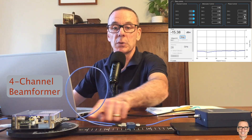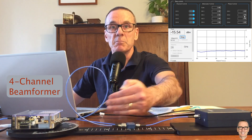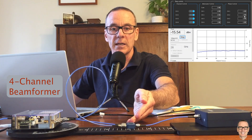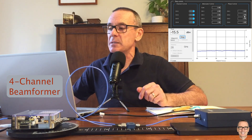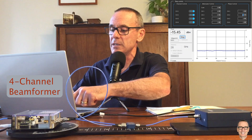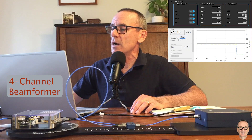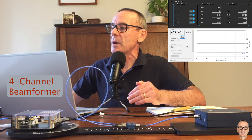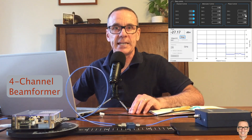The length of the cable between where you set zero phase and where the actual antenna is plays a very important role in ensuring complete constructive addition of the two waveforms. We should also look at where complete destructive interference happens — rotating by 180 degrees is 32 steps, so 32 plus 4 is 36. Setting step 36 causes the signal to drop, confirming exact cancellation. Setting 37 or 35 brings it back up, confirming that 36 is precisely the destructive interference point.